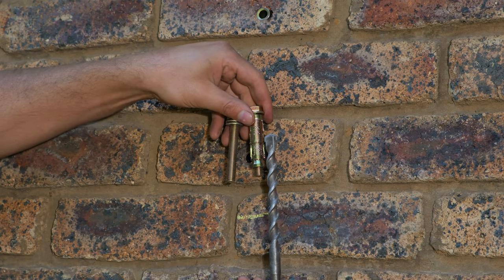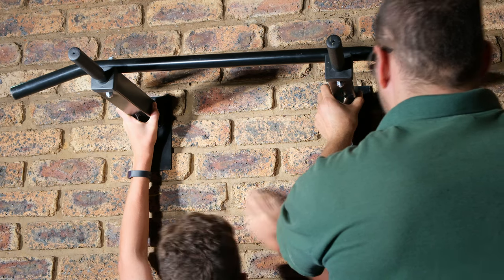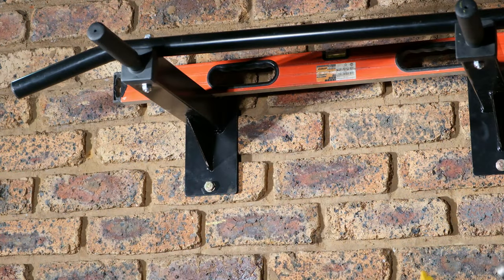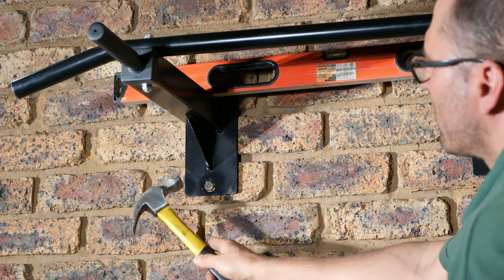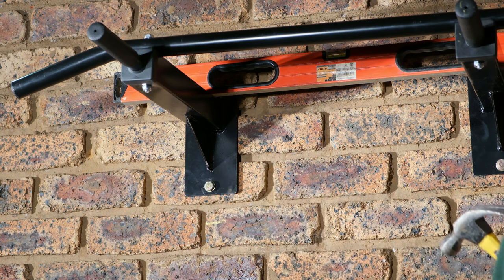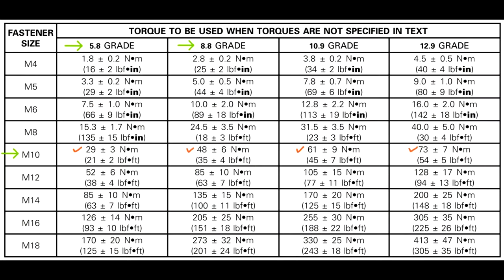For your reference this is an M10 and I used a 14 millimeter bit. Before I tighten the expansion bolts I just check that these are straight, because if they're not you can just tap them either side to make sure they are straight. In my case they are straight so I don't have to make any adjustments. I want it quite tight but I'm going to use a torque wrench for calibration purposes. Depending on the grade of steel determines the torque setting — for an M10 if the grade is a lower grade say 5.8 then I must only fasten it to about 30 newton meters. If you're using a higher grade metal you can go all the way up to 73 newton meters plus or minus seven. Always consult the manufacturer's guideline — this table is just in case there are no recommended torque settings.